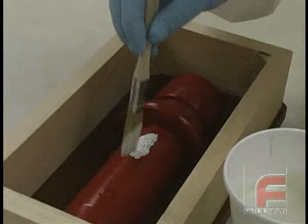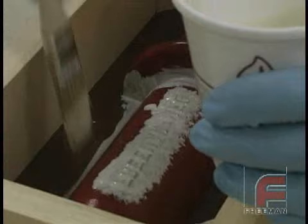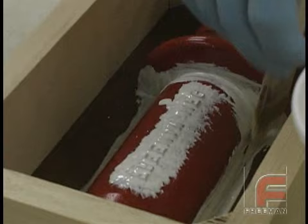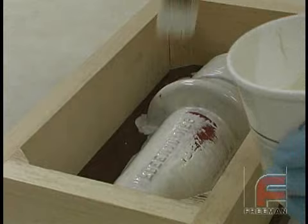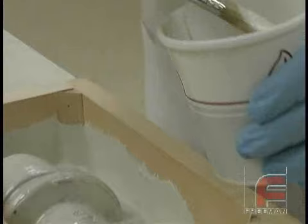The Repro Surface Coat starts out thinner than an epoxy, so we want to start out by covering the areas of our part with the highest detail and the corners. If the viscosity is too thin, such as for applying material on vertical walls, we would wait a bit and it will thicken up. We will be applying two layers of surface coat, so we are not as worried about getting everything the first time around. We are not worried about excessive buildup as with an epoxy because Repro doesn't produce a lot of heat.